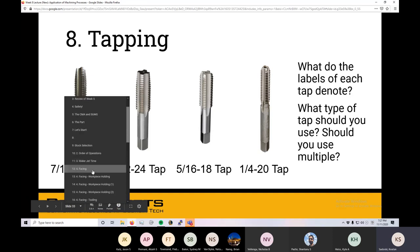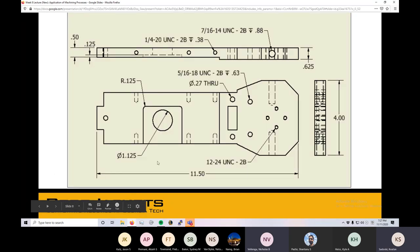These are what the taps look like commonly. You already have the undercut hole, fasten these to a handle, lube up the hole, and start driving in a couple turns then driving out a couple turns. For the quarter-20 tapped holes in our drawing, you look up what the tap is for that thread size. Typically we have taps for whatever common hole sizes you're trying to use. Ideally you'd vice the part down and drive at it perpendicular to the face you're tapping into.